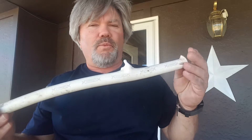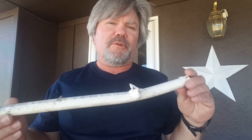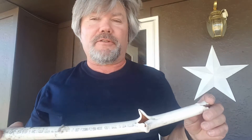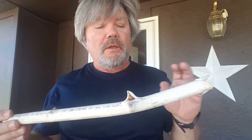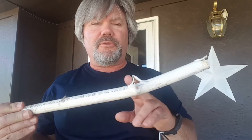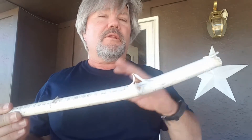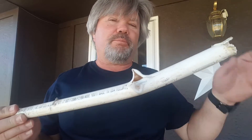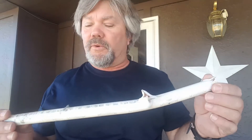The way this happened was there was a safety device in the system that failed, and there was another issue before that which caused it to fail. What happened was the water last winter froze and we had no water in the house. This is one of the pipes that leads up to the wood stove that we use to heat the water. When the water froze there was no more water pressure in the lines and the water pump wasn't able to push the water through the wood stove to circulate and heat it.